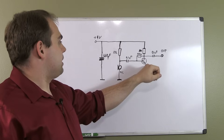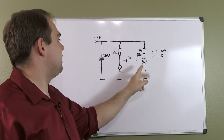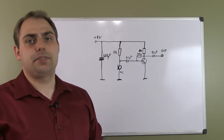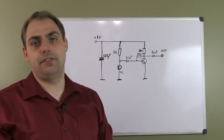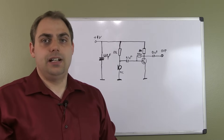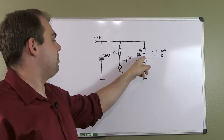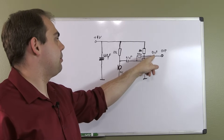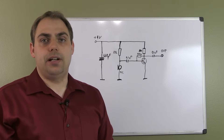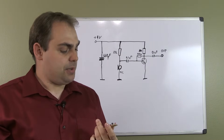Here we have a very simple transistor amplifier — a 10k resistor on the collector, then a 220k resistor to bias the base a little bit. I didn't put a specific transistor name on the schematic because pretty much any type works. I used a BC548, but any NPN transistor like a 2N3904 or 2N2222 works just fine. We're coupling out the amplified signal from the collector using another 0.1 microfarad capacitor to the output. In another video I'll show the double sideband modulator, but for now let's move over to the workbench and have a look at how I put this together and hook it up to an oscilloscope.